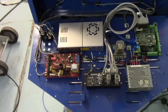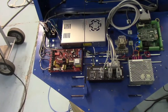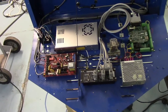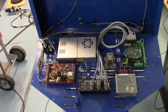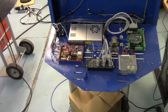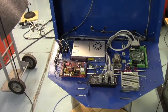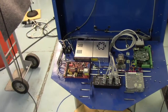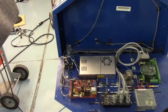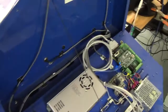All in all, pretty simple. This was a really easy conversion and it works really well. I just wanted to share it as an example of some of the things you can do with the Centroid CNC Acorn step-and-direction motion controller on a benchtop mill or even a full-size mill — as long as you have stepper drivers that take standard step-and-direction input, you can drive it with the Acorn motion controller.